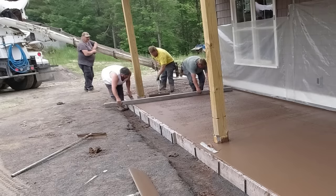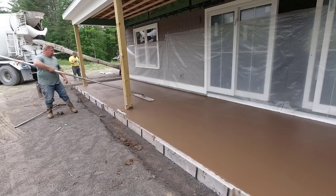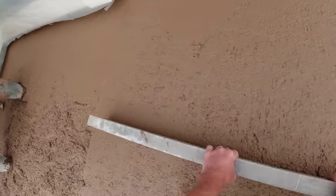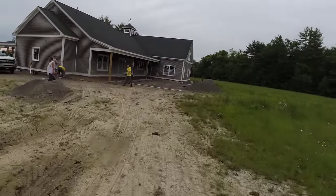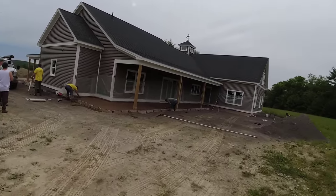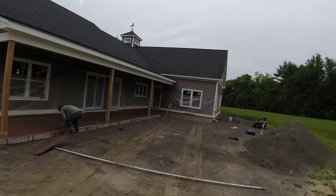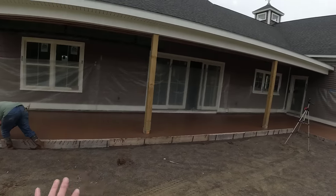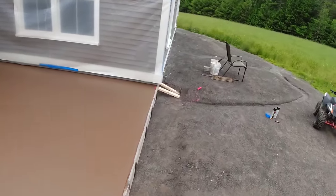We've got poly up against the house so we don't get any splatters on it. It's about 85 degrees out and really humid — a midsummer day — so we know this stuff is going to take off on us and we're really hustling. We're doing 16-inch barn board today with sienna brown integral color. We'll use a charcoal teak wash but just clear release today, running the planks lengthwise. Two loads — hopefully the first sets up a little quicker. I'd say we've got about an hour before we get started.